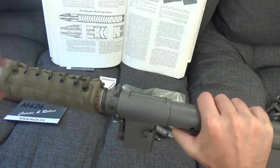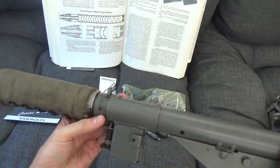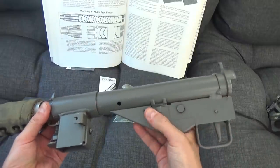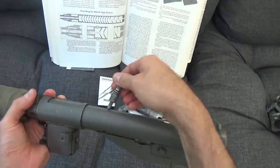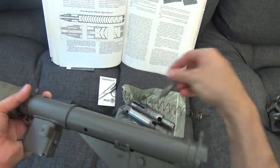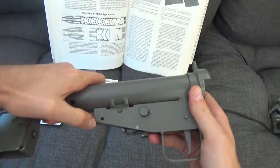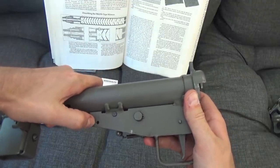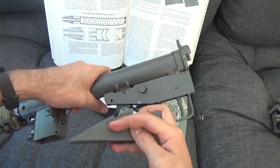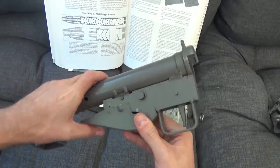In the absence of the real thing, this is a pretty good fake. It shouldn't confuse anyone who has access to the book, but I like it. Other things we know: it has the later hole modification for the push-through safety on the cocking handle, to block the bolt in the forward position. From the location of that hole, we can say this is a pre-April 1942 receiver, although the trigger housing cover is later because those dimples go with a bigger unthreaded hole up there. So this really should have one attached with screws, but it doesn't.